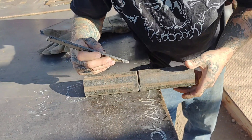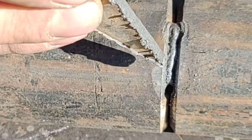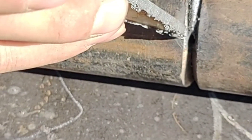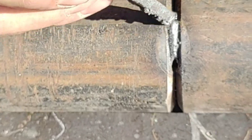These tacks are both different. But you can see right here how you can see most of the bevel — that's a good indication that bead is soaked down in there. And when you come over here, you can see there's just a little bit of that bevel, and there's not much here. That's a good indication that half of this weld is not inside that pipe.